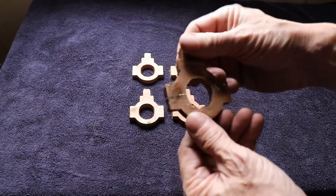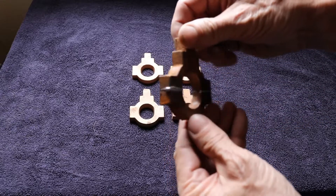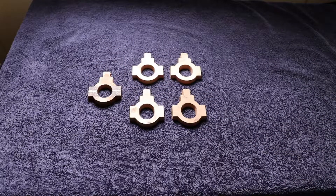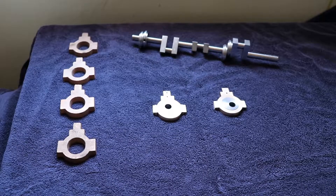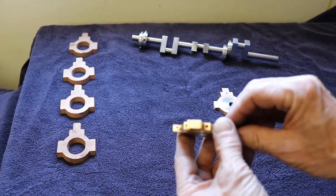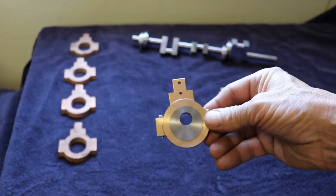You'll notice that the inside is just slightly out of round. The reason is you've got to slice them in half in order to complete these. Here's one that I've already done that with. What I did was I soft soldered it together. After I sliced it in half on my bandsaw, I machined these surfaces perfectly smooth and then soft soldered it together so it could be mounted in my tooling.